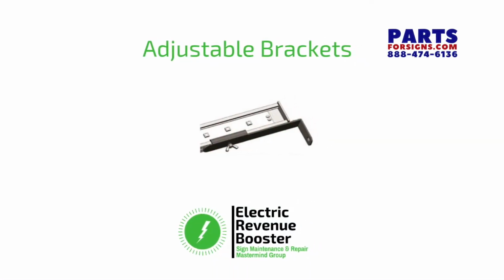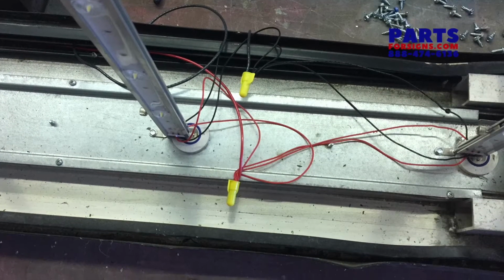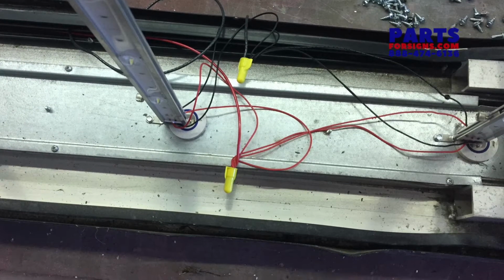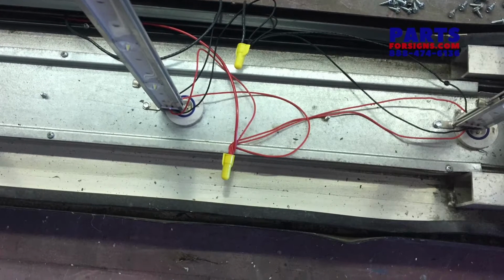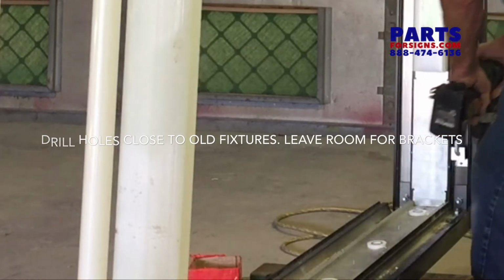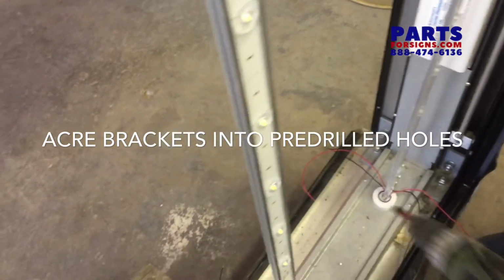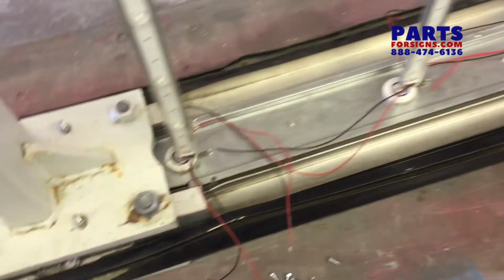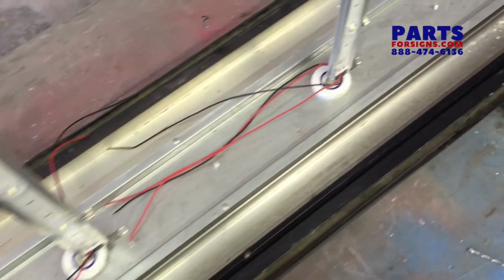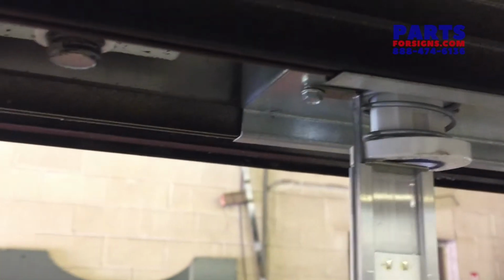These thumb screws allow these brackets to be adjustable. I had to loosen them with a pair of pliers. They come fairly tight. So you loosen them, you get an idea of positioning where the hole is in the bracket. You can adjust these fastening brackets to fit over the sockets where the lamps were. Snug all those up.